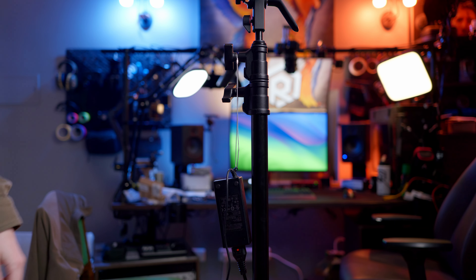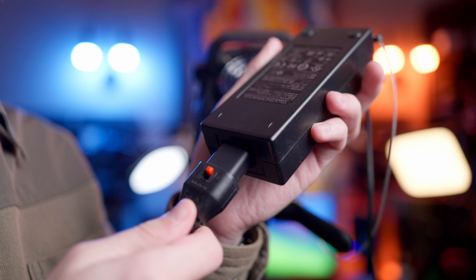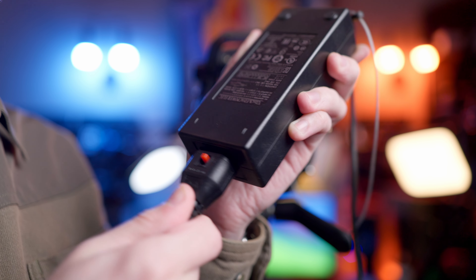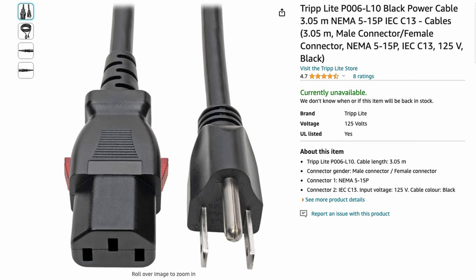On the other hand, you won't need to hang any power bricks on your light stands. And if you want to extend the power cable, you can just buy a cheap C13 cable extension from the hardware store. Since it's running line voltage, it could virtually be of any length. The default connector is unfortunately non-locking, which means it can wiggle out when handling the light. It would have been better if it came with a locking connector like Amaran lights, but locking C13 connectors work on any C14 socket, so you can just pick one up from Amazon.